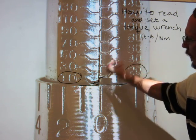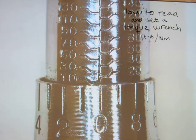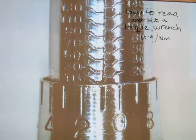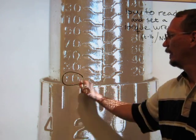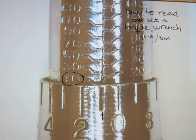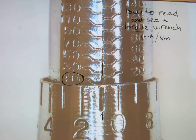Let me show you a couple of examples. Right now the torque wrench is set to exactly 10 foot pounds. As I rotate the handle forward it's set to 11 foot pounds. The tens amount comes from the main scale, and the ones amount comes from the handle. At this moment the number 1 on the handle is aligned with the main vertical line, and the horizontal line we barely passed was the 10 line - so this is an 11 foot pound torque setting.